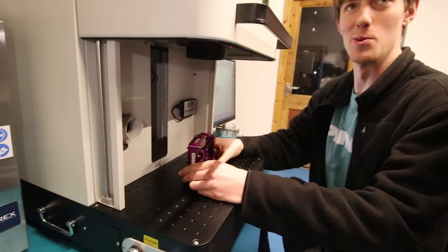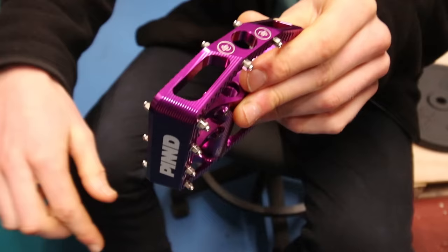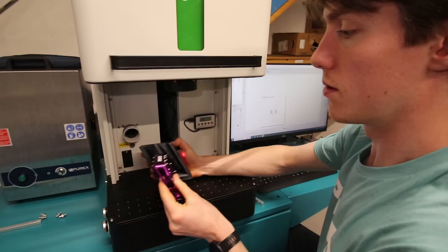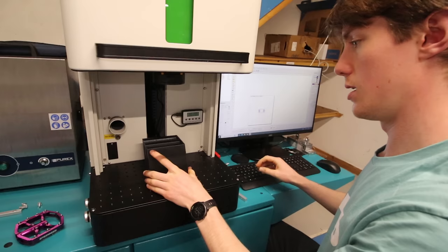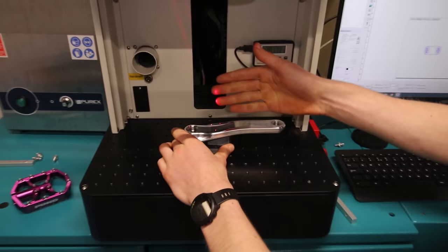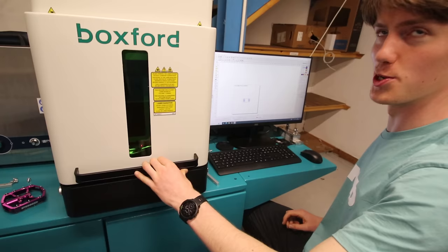This is showing where the logo is going to be marked on it. Because it's a small run, lining it up by eye is fine — it'll be pretty quick. They side-load the pedals into the fixture, use the pins to secure it on the underside, and that allows consistent, secure logo marking every time. Close the door, press the pedal — done. Takes a couple of seconds. It is so quick.